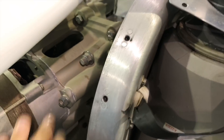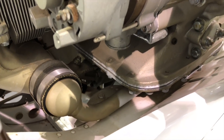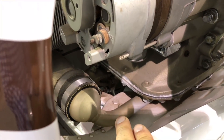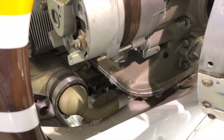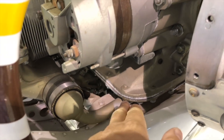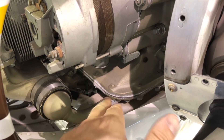I don't think I can show you the elastomeric coupling and all that, the gear meshing. One thing you can see very well because the baffling is gone is that crossover or balance tube on the intake system. That should be inspected — as I went to a service clinic just to observe, one airplane had a crack in there and the airplane was running really hot and lean, possibly getting additional false air through that cracked balance tube.